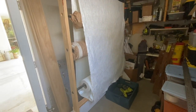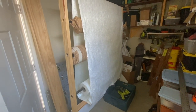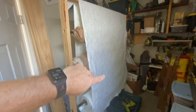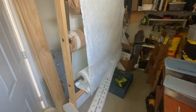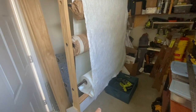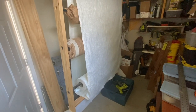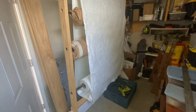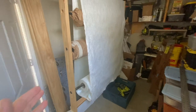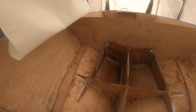All right, so this is my little rack — my resin setup — and this is inside the shop here. It's a rack because I've got boat stuff laying everywhere. What I do is I take this bottom roll, roll it into that little void, and bring it up over the top. I have a 48-inch measuring stick there. I need 45 inches, so I'm going to come up 45 on this side, 45 on that side, make a mark, cut it, then take it outside and trim that extra 5 inches off. That's what my fiberglass rack looks like. It's been working pretty good — I keep it in here so it's not subject to all the dust, and it keeps it protected from weather, moisture, and humidity.